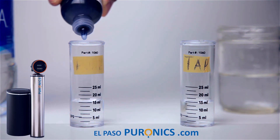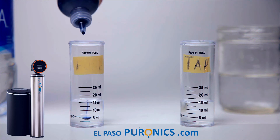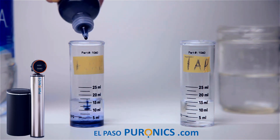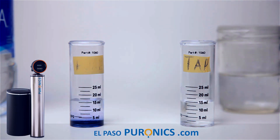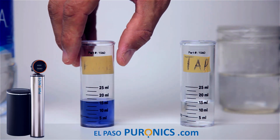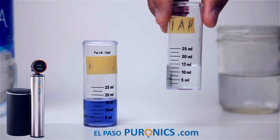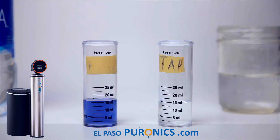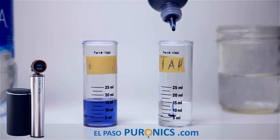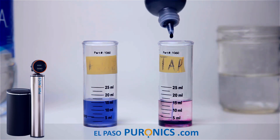Just so you know, there are 30 grains per gallon in Horizon and 15 in downtown El Paso. If the water is blue, that represents it's purified — no hardness. If the water turns pink, it means it's very hard. This is the neutral color, and our goal is to make the tap water sample match that color. Adding 15 drops to the tap water side as well.